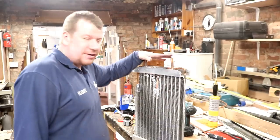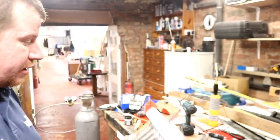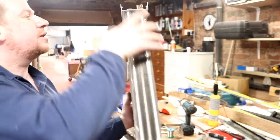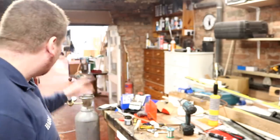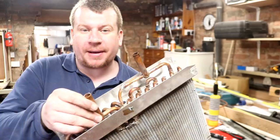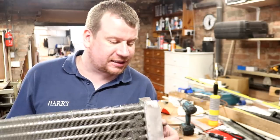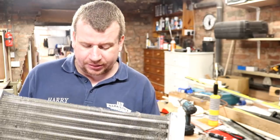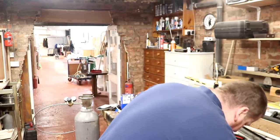I've lost my patience with it. I've tried several times to resolder certain joints and it's worked — the joints I've attacked I've managed to seal back up — but you're chasing your tail. You seal one solder joint and something blows somewhere else, then something else, and I'm on my fourth one now and I can see something missing down here. I'm not going to bother. I'm going to see if we can set up that car radiator and just replace this matrix with a car radiator. If anyone knows where I can get these with copper pipe outlets please share, because I could really do with finding a decent supplier. Car radiators cost about 25 quid so it has to be in that ballpark — the good thing about the originals is they have 15mm pipe outlets whereas car rads don't.